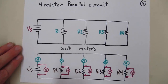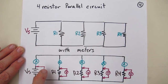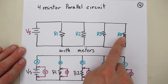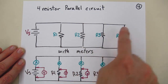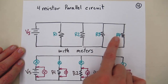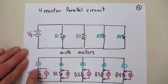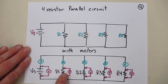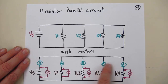For the second part of week eight, we're going to use Ohm's law to explore parallel circuits. After you're done with series, you'll set up a circuit of four resistors all in parallel. The parallel circuit is intuitive as you look at it because each one of these resistors is in parallel with the other. We're going to set it up so that we can take the voltage measurements on each component easily and take a current measurement on each component easily.